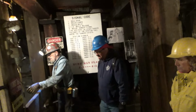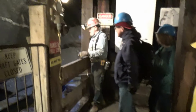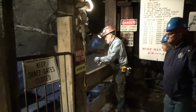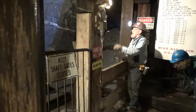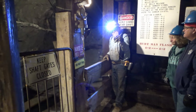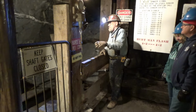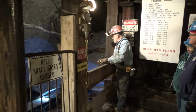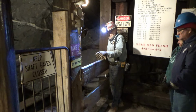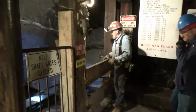And so they would go down there and they'd drill and blast, and then you hoist. There would be a big hoist behind us. It would lower this bucket, the miners call it a skip. It would lower that down there and they'd load it with rock, and it would hoist right above us and dump it onto a slide. And the rock would slide down and drop into an ore car, and they take it out and dump it outside. So all of this rock that came out from there, like 400 feet south there, all came up with that bucket. That's how they got it all out of there.